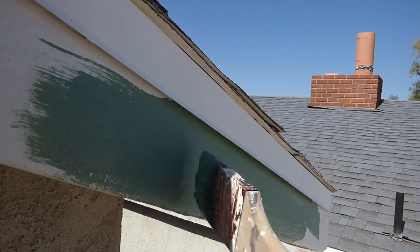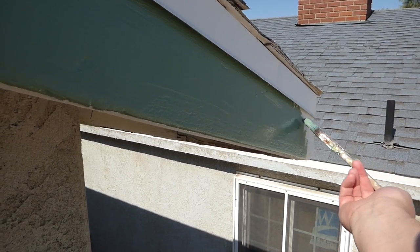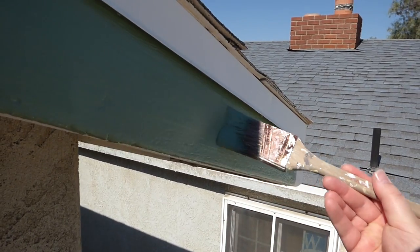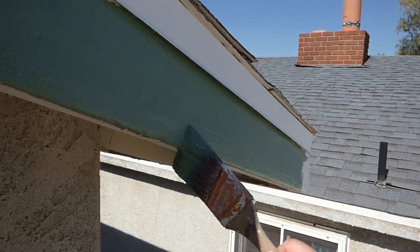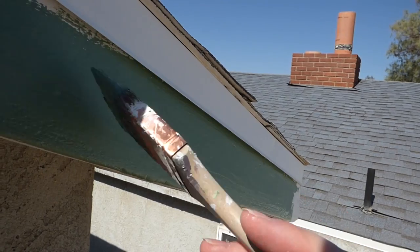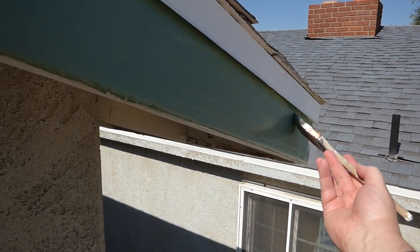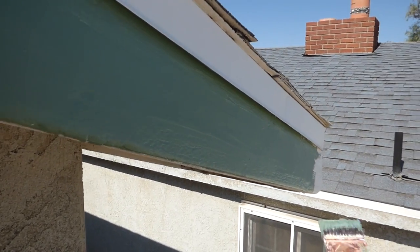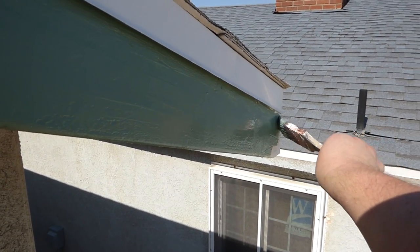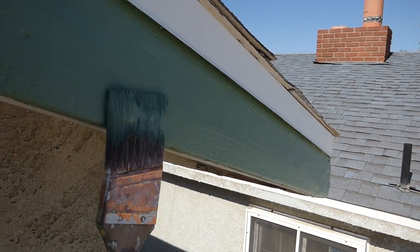It also keeps the moisture out from the rest of the stuff, because that putty we used earlier doesn't like moisture. So if it's going to rain and it's not dry, it's going to suck up that water. It's going to put a nice coat on here. On color choices — in the desert, you probably don't want too dark, because the darker something is, usually the more heat and sunlight it absorbs. They also say if you do semi-gloss or gloss finishes, they last longer. Likewise, there's stuff you can put in to kind of inhibit UV — a UV protectant, either in the paint itself or as another coat. So this is about it.